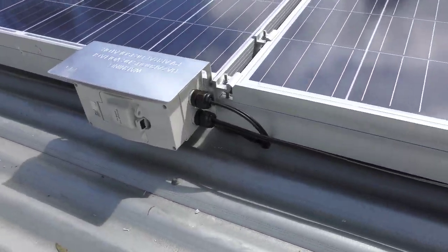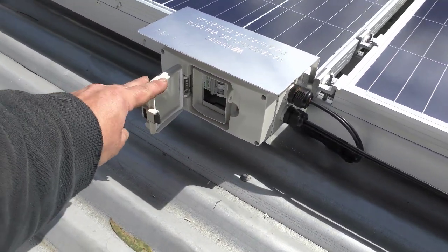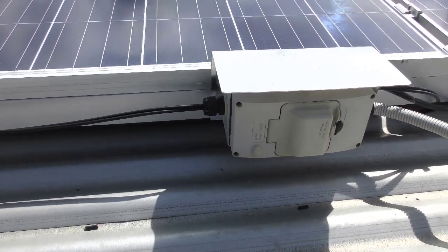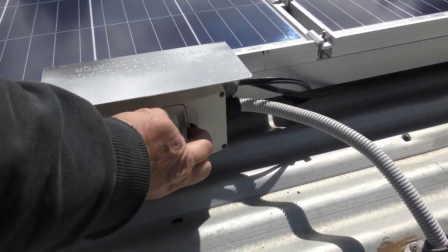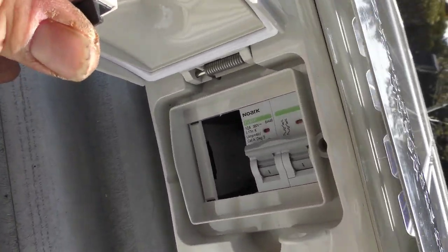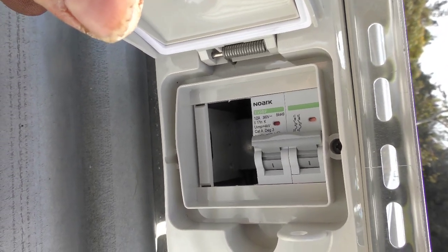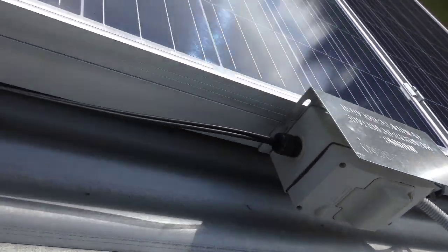I didn't have any of these boxes or any circuit breaker spare, so I've got to put a filler plate in there — I simply left it disconnected. Also, I only had 16-amp breakers, but now I've got replacement 10-amp breakers. Both of those strings in there have got 10-amp breakers and they're all hooked up, ready to go.